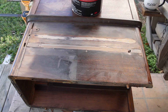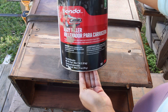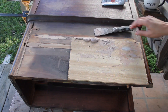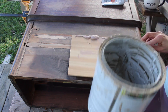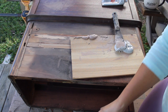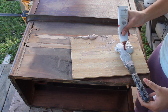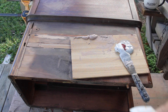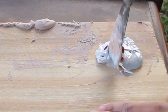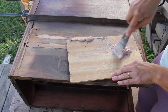This is what it looked like once I removed those connecting pieces. To patch the entire thing I'm going to use Bondo — we usually buy a big tub because we use it a lot. It hardens fairly quickly, you can sand it, and once you sand it you cannot tell it's been patched. You put some paste out and then apply a little bit of the hardener. Work with small batches because it hardens quickly, so I'll mix a little bit until it changes color, then apply it to a small section and mix more as I need.